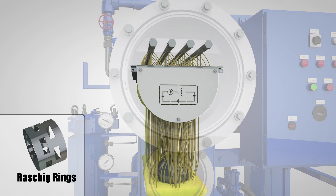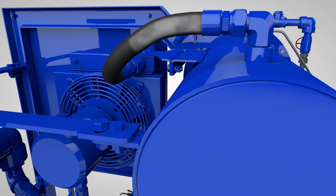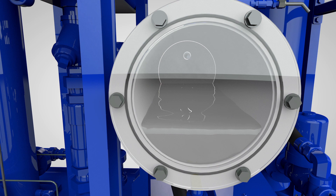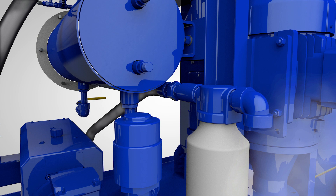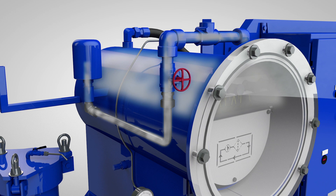The oil spreads out in a thin layer throughout the permanent dispersion media, promoting separation and allowing water and entrained gases to boil out of the oil. The water, steam, and entrained gases that are removed from the oil are pulled out of the vacuum chamber and through an air-cooled condenser, where some of the vapors are condensed into free water, which collects in the condensate sump. The majority of removed water is emitted out of the discharge of the vacuum pump into the atmosphere as moist vapor or steam. Allowing a small amount of ambient air into the vacuum chamber, the process of mass transfer helps to maximize the water extraction efficiency.